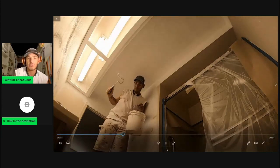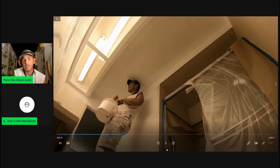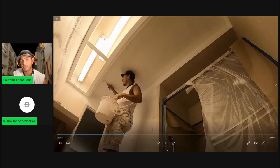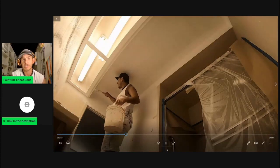Sanding is usually the option I'll choose — I'll go through and lightly sand down all of the walls if I don't want to use TSP. There are all kinds of different factors that come into play. After you've got the walls clean, I like to finish the ceiling first and to completion.